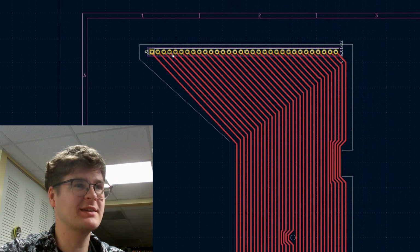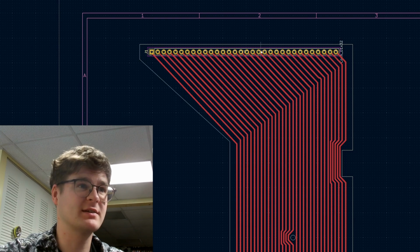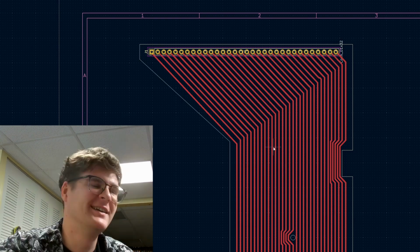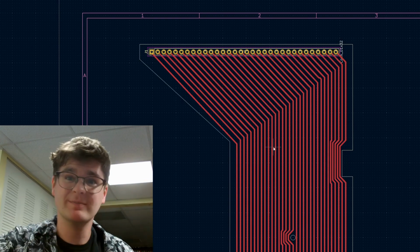The only downside about manufacturing this PCB at home is the traces have to have a minimum thickness in order to resolve properly. Which means you get this kind of goofy single line of wires up at the top, just because the traces can't go in between the pads. Would have loved to use a box connector. Would have made the whole thing a lot smaller.